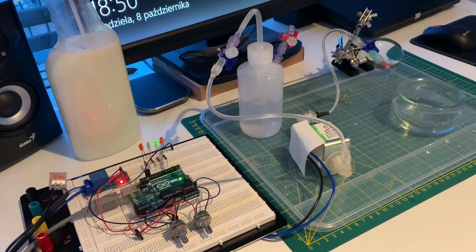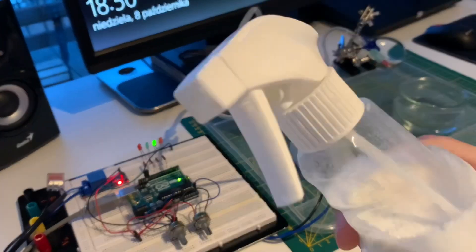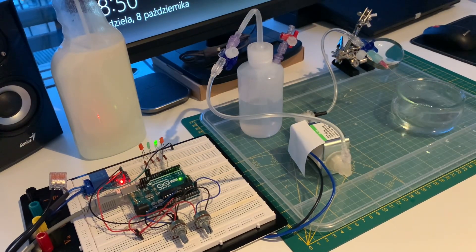This system is different from a typical minimum quantity lubrication system — it doesn't deliver a lot of air to blow chips out of the way, but it provides a precise jet that you can direct exactly at the cutting tool and deliver a small quantity of lubricant from time to time. This seems to be a good alternative to manual spraying, like many people still do. Okay, that's it for today — stay tuned, and the next video will show the system integrated on my small CNC machine.